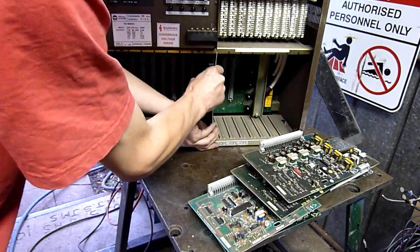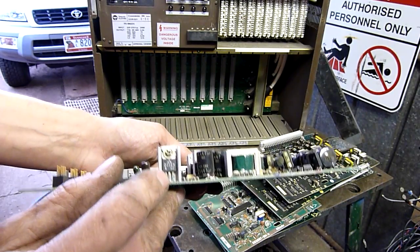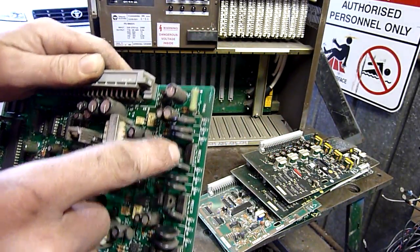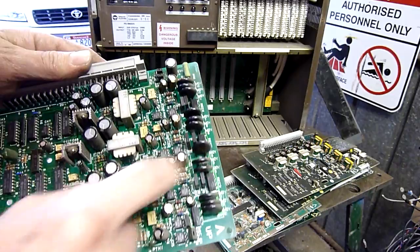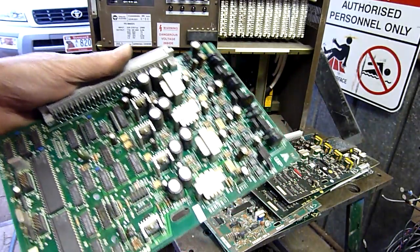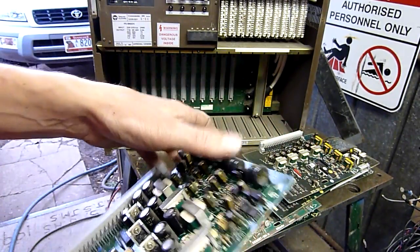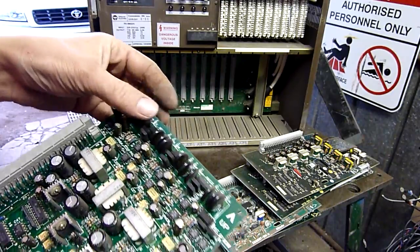This one's a little different. There's a D1169 Matsushita Electric — four of those. Metal Oxide Varistors. This has got surge protection and everything on it — this is probably interface with the main line. It's got surge protection, optocouplers, isolating transformers, audio transformers. Yeah, this is probably interface with the main telecom line — that's why it's got all this extra componentry. It's not garbage; it's actually quite necessary. Yeah, this is line interface.